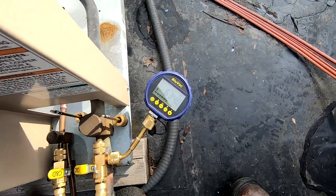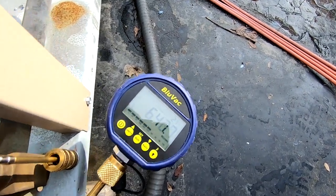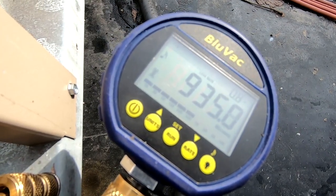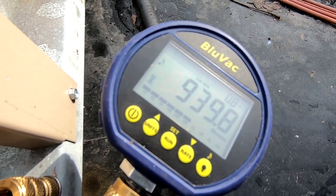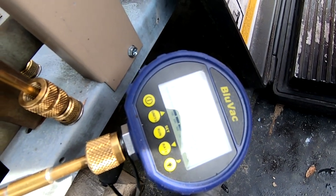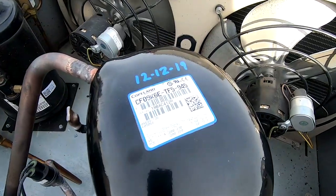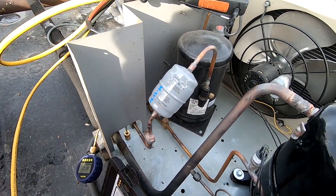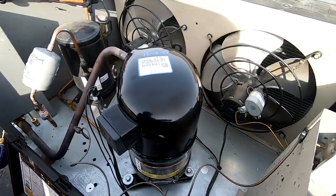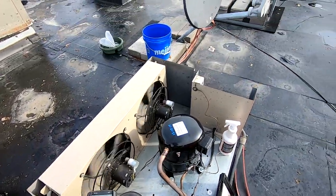Here goes our blank-off test. She's luckily slowing down - top right corner there is our leak rate, just leftover moisture or refrigerant. We're going to let it pull vacuum for a little bit longer and then get this thing recharged. She's down to about half a micron a second at 700. I'm going to say we're good. Got the official date on both items. I did go with an HH oversized dryer - 163, it was an 083 in there before. We're going to get the disconnect turned back on and get this sucked in for the remainder.